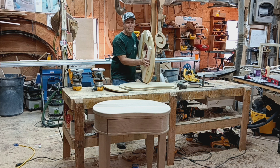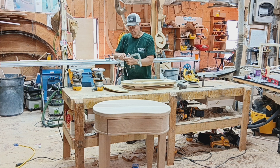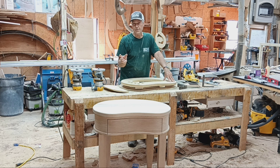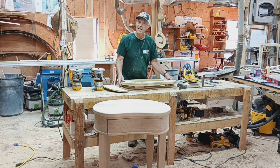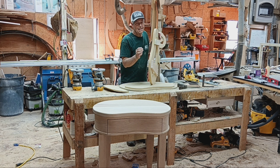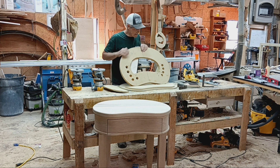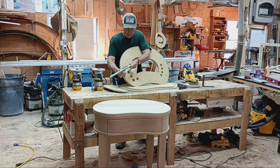It's also important to put some cleats on the bottom of the form, because as you're using the clamp, if your form is right down on the surface, there's not much room to spin things — little things I kind of learned. I put masking tape around this to make sure that glue getting out didn't end up with my trim piece stuck to the form. Once I'd made the piece, I cut out the middle so I'd have places to put clamps. And around where I had the tightest radius, I drilled some holes so I could get clamps in there — you could do that all the way around, but the only place I really needed it was right there.